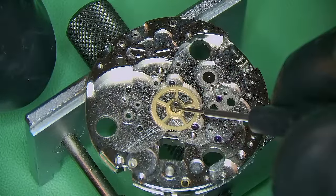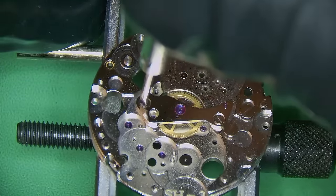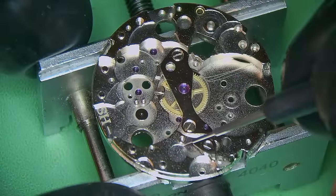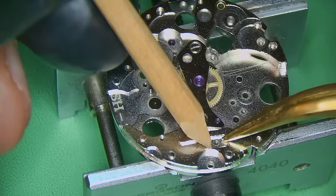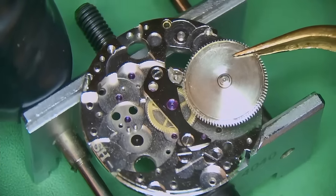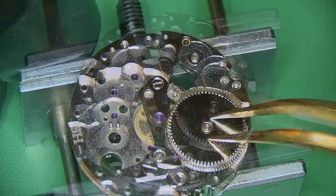I'm adding a little bit of 1300 onto the jewel where the center wheel is going to go, and also adding 1300 to the top for where the bridge is going to go on top. I am really impressed that we have a lot of proper jewels on this watch — not these thin little plastic things like I've seen on the Amazon and AliExpress watches. For the posts I'm also using 1300. Then I've added the click spring and click into place, testing it to see if it engaged correctly — we've got some friction, which is what we want. Now I can add in the mainspring barrel complete, with a little 1300 onto the top of the arbor for where the ratchet wheel is going to live.